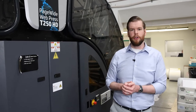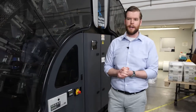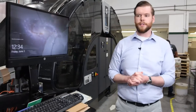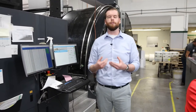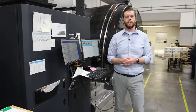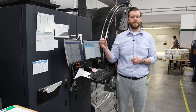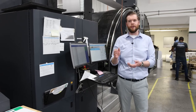Let's walk a little further down the line and talk about some of the other innovations that customers like DG3 are taking advantage of. We have an onboard vision system on this press. The vision system monitors quality as we're running, looking for voids in ink. It checks your RIP file output, determines where ink should be — such as cyan — and if it doesn't see it, it raises an alert to your operator.